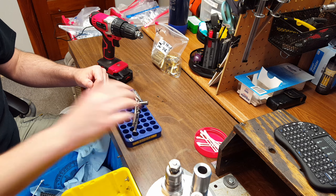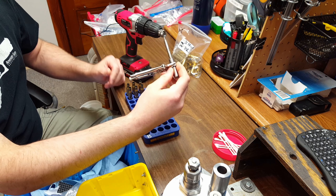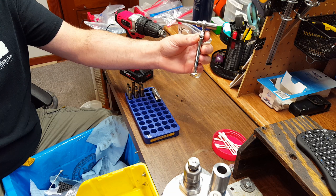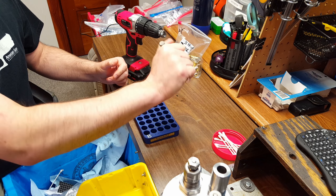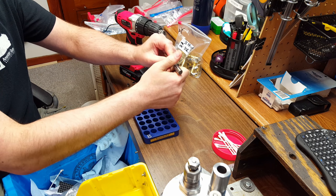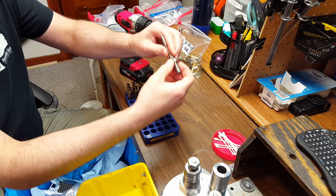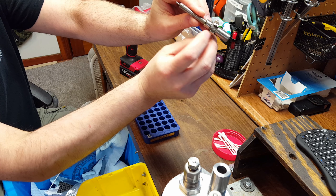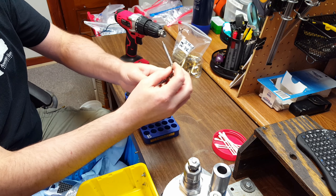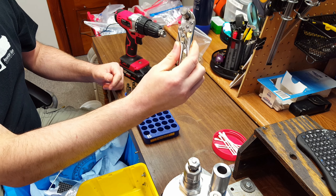So that really annoyed me and I always come back to doing it this way. For the cutting end, they have this little knurled piece which you can hold with your finger, or they have a ball attachment. But I took a little vice grip so that I have a 90-degree angle here — that way I don't have to exert really any force with this hand because I don't have to grip it hard to keep it from spinning. There were times using just the knurled piece where the brass would catch and I'd end up gouging my fingers on the cutters, so that's why I grabbed this cheap mini vice grip from Harbor Freight — it really works well.